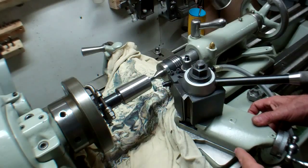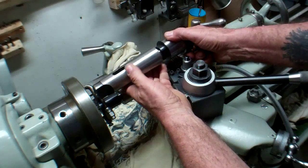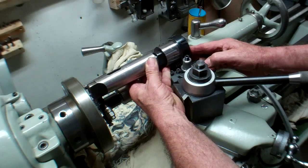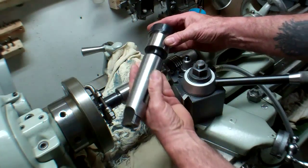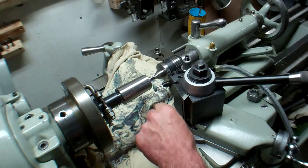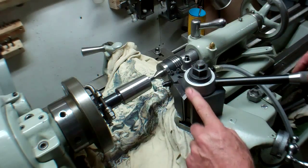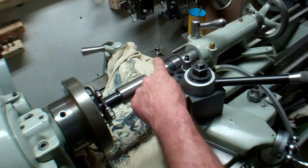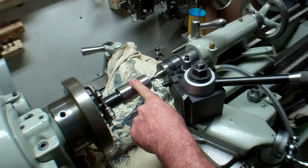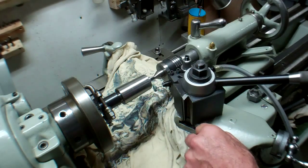Here's a little experiment I'm going to try. I was worried about this long adapter — worried that it would be off at the end — and I checked it and it's dead on. But it is off. So I set it up this way because I don't have a big fancy tool post grinder. I got it set up on dead centers, with a dog and dog plate, mounted on one of these blank number three Morse taper blanks.